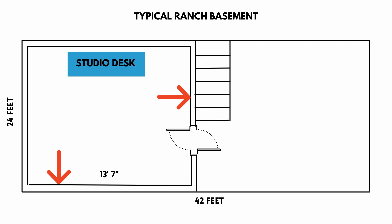We're also going to put in a double wall system. You're going to frame a new wall with a one-inch air gap all the way around your studio room. This is because we want to create some isolation from the outside walls to the inside of our studio, and this is the best way to do it. You've got plenty of space in that basement to do the double wall system, so I think it's totally worth it.